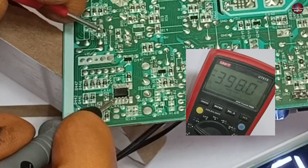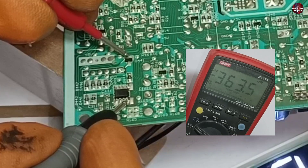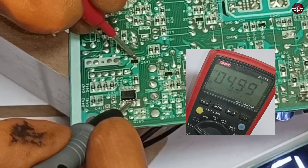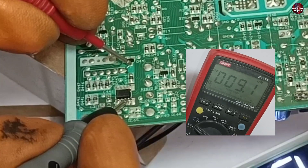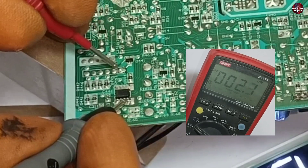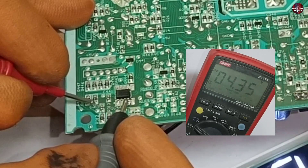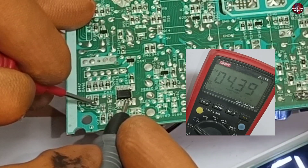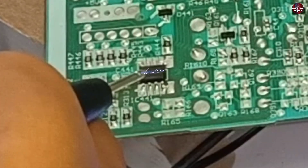I will now check whether these voltages are flowing here or not. I have placed the black probe on the EPROM ground pin, and the second probe on the diode pins which are attached together — 4.9 volts pass through these pins. Next, I am checking the diode's voltages from the front pin, so 4.39 volts are passing here. Some of the voltages are dropping due to the presence of the diode. Now I will check the voltages across the resistor — 4.39 volts are passing here as well. The next resistor also has the same volts, and 4.38 volts are also flowing through pin 8 of the EPROM.